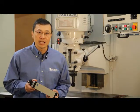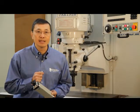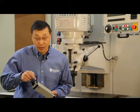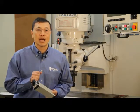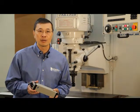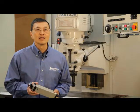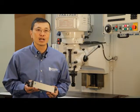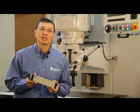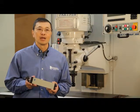The laser is unique because it is a single aperture based on our patented Doppler displacement technology. The incident beam and the reflected beam share the same aperture. This eliminates the need for an external interferometer, bulky optics, and the use of a tripod, simplifying the entire setup process so you are actually spending much less time setting up the laser than time spent performing the measurement and compensation.